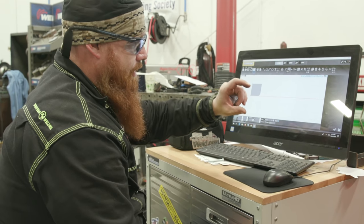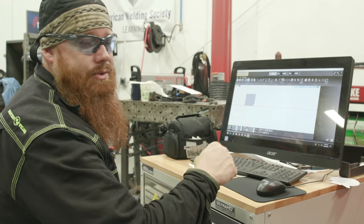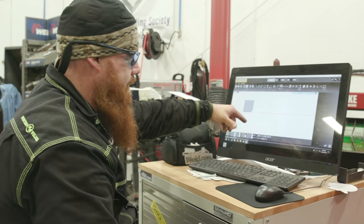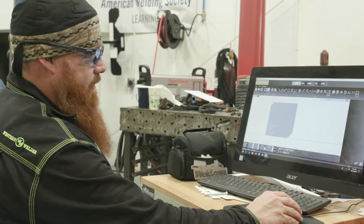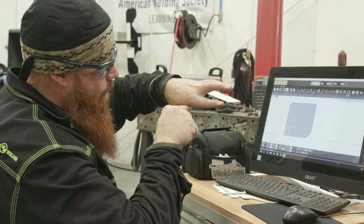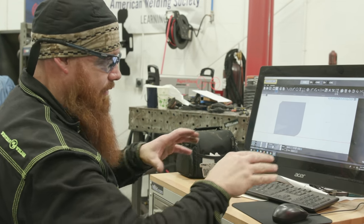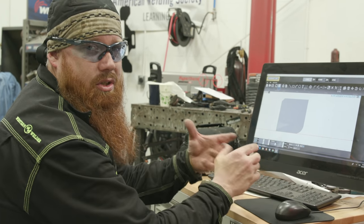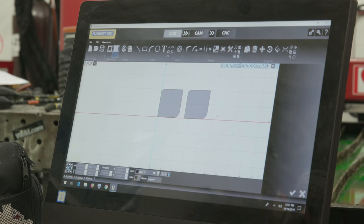All right, so right now I'm just gonna build some little tabs that are gonna go on the inside of the grill. So we'll have locking handles on the inside. I'm just gonna build these 2x2. I'm gonna put a 1/2-inch radius in here so there's no sharp edges on the inside. Right here I put a little 3/16 chamfer because it's gonna sit right up in that square tube frame, and I've got a little weld in there, so I just notched out the corner of it. And this part right here is radius, so if anybody ever puts their hands in there to do anything, there's no sharp edges that are gonna catch wrists or clothing. I'm just gonna go ahead and duplicate this because I need 2 of them. Put that right there and we're good to go.